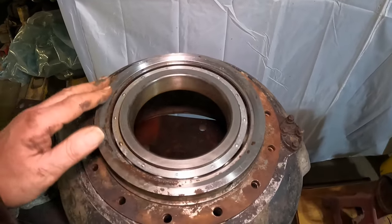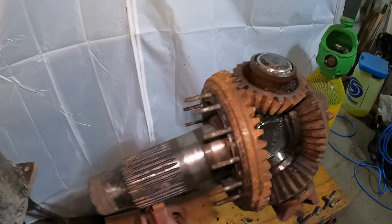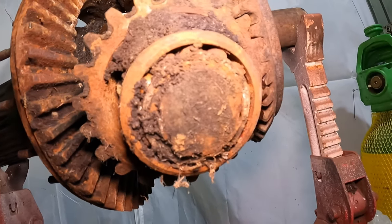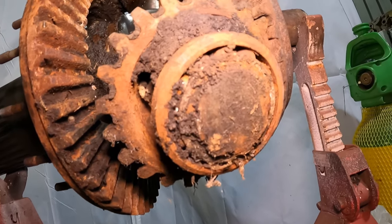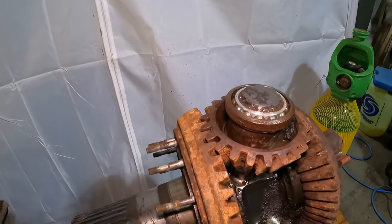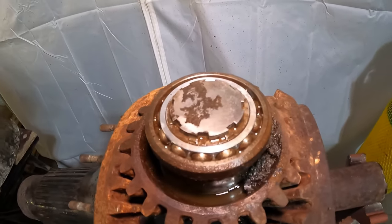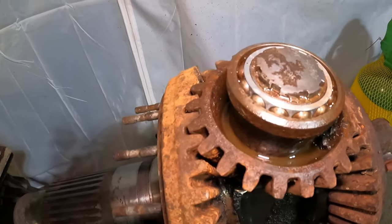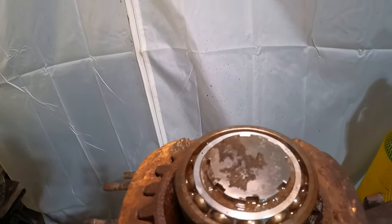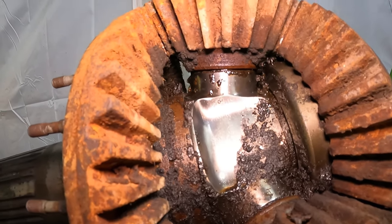So, with the amazement of this piece of engineering, my attention focused to the reduction gear, and all the bearings just like this. You think, not much chance of those cleaning up. However, I did give it some lubrication, some penetrating oil, and let it soak, give it a bit of a blowout with the airline, and then give it another soak and another soak. And it's now letting the fluid run out of the bottom.